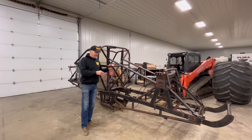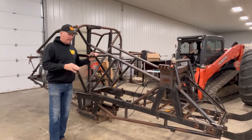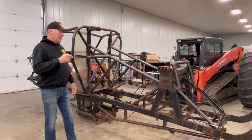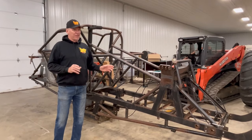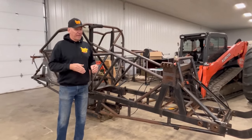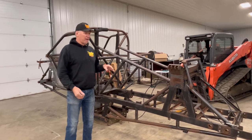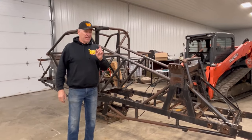This one I built complete, 100% my design, my build. Didn't have any help. 2x4 main frame, 3/16ths wall, 2-inch DOM, 1/8th wall — that's basically my chassis. Did a great job for ten years. Back in 2000, suspensions were just coming out. They got the hell pounded out of them in the 90s. When it hit 2000, when I entered the field, they finally started getting some suspension systems rather than just a little old coiled spring like the trucks in the 80s and 90s.